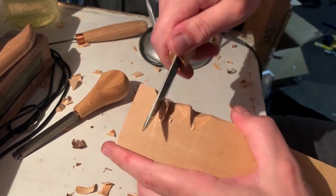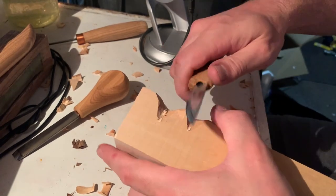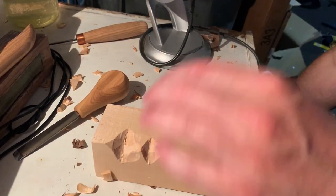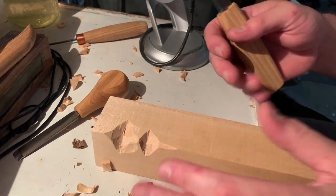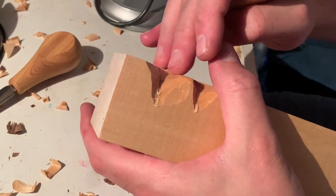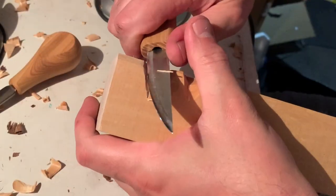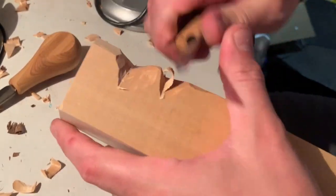You can get through wood with all kinds of materials. Like Samoan and island-type tribes would do a seashell or a piece of jade on an adze and you could get that into wood. The blunt force gets a denser material through the wood. But when you get down to hand pressure and you want it to cut real clean without tearing — meaning it's sneaking through there so small and tight it's not disrupting the wood structure — you absolutely need steel.